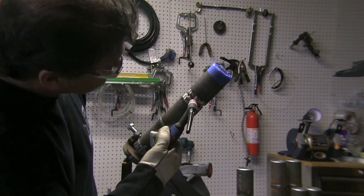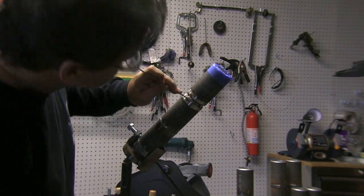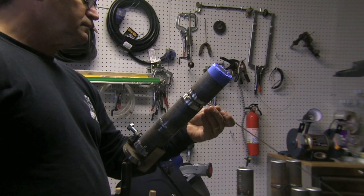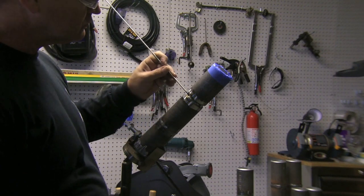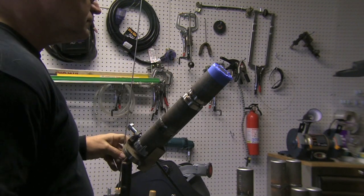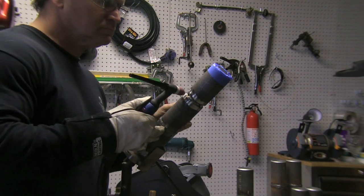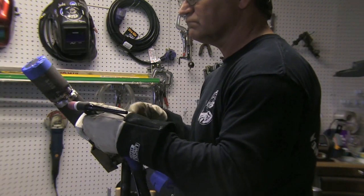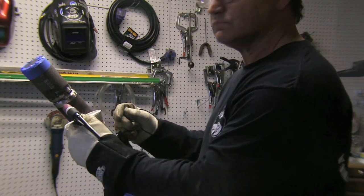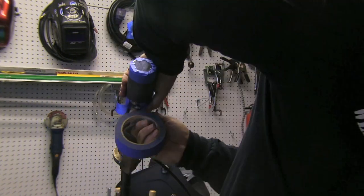Right now I'm taking lots of dry runs, making sure I can prop in a good place and that it's the right height. That's another issue — usually the inspector will come in and once it's set, it's set. They might put a stamp on some areas or measure to an indicator so they can tell if you moved it. So you've got to figure a height that is just right: high enough so you can get access to the bottom but low enough so you can get a good line of sight on the top. Make sure the gap is all right with a 1/8 inch rod, get a little heads up on what to do — have a plan. A few little dry runs like this will pay dividends.